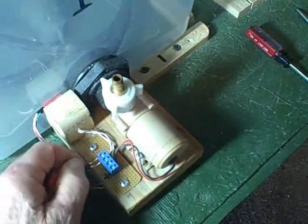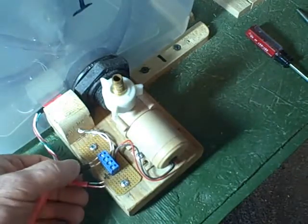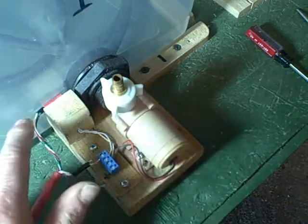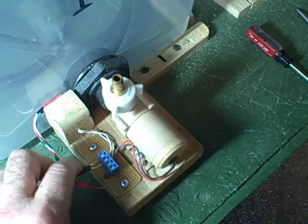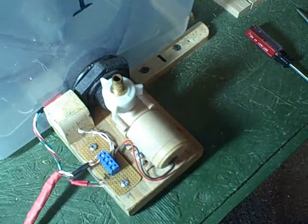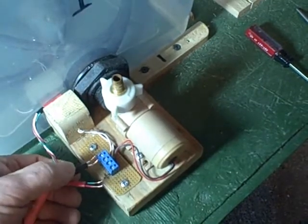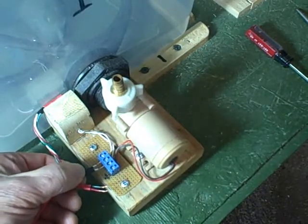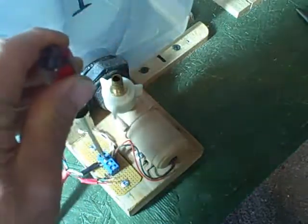The next sensor has a terminal connected here and also presses against the tank. This is a thermistor probe, and this goes to our differential controller. Now let's install this — there are just two white wires, so they go right in here. Tighten it up before installing the next set, otherwise it'll just slide right out. Our thermistor sensor is now connected.